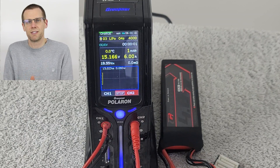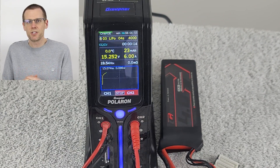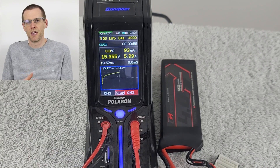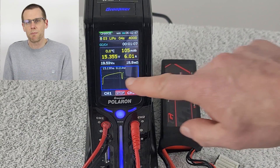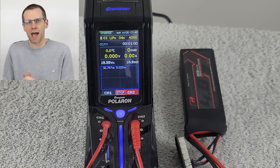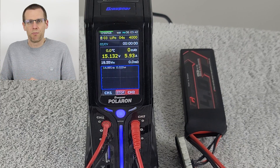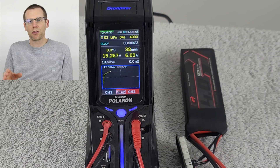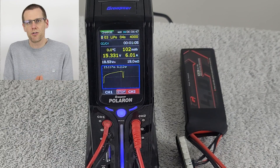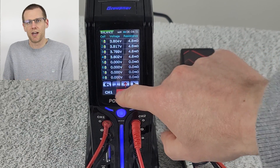Let's start by charging up the battery pack to get the internal resistance reading. That first reading on this charger comes at the one-minute mark, which is the ideal spot to grab the internal resistance. The internal resistance is measured while charging the pack at 1.5C — for a 4 amp hour battery that means charging at 6 amps. We'll average the internal resistance values from both packs and plug that into our RC calc sheet.